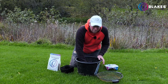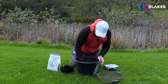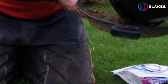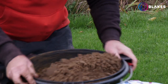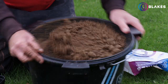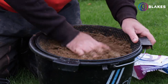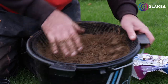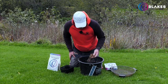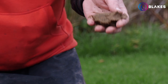Just make sure you get enough water in so all them particles can actually absorb it. So I'm going to give that a little turn round and then quickly — obviously I would leave that to set, but just to show you — I'd quickly run it through the riddle. Pass it through the riddle and you can see if it's sticking through the riddle at this point you've probably added too much water. Riddle most of it, get them lumps out, just keep turning it with a little shake, try and do this as quickly as possible, and what you'll be left with is something you can squeeze together — which is absolutely perfect.